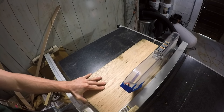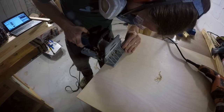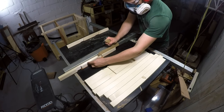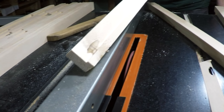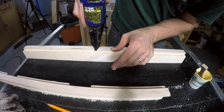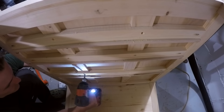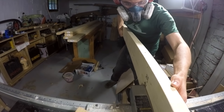I went ahead and ripped some strips of oak to dress up and add support to that half-inch plywood shelf, to be attached later using biscuit joints. The slides for the drawers are a little different from the shelf supports — I cut a rabbet in the side facing the inside of the cabinet to reduce the bearing surface between the drawer and the slide. Then I attached a maple strip to the bottom that the drawer would actually sit on. Maple is nice and hard so it won't wear out as quickly, and later they're all waxed for a really smooth action. Pocket hole screws attach these pieces along with additional screws into the vertical parts of the end panel.